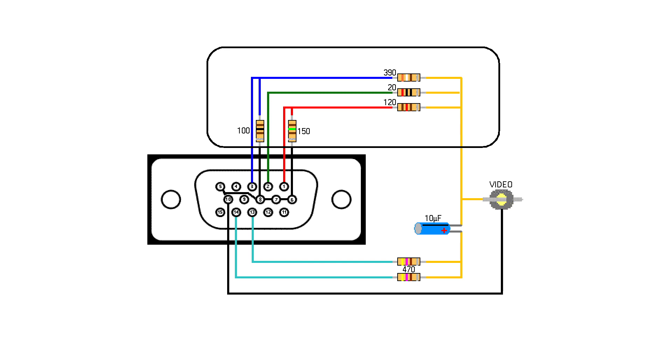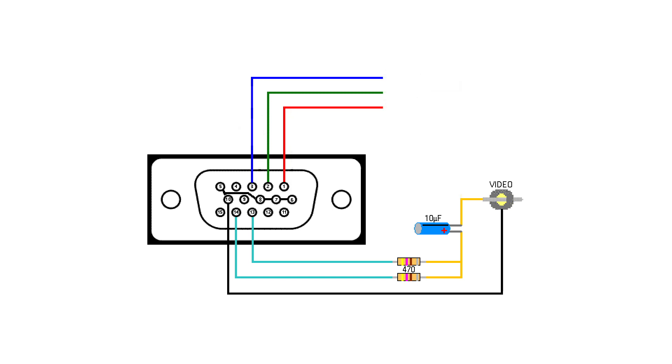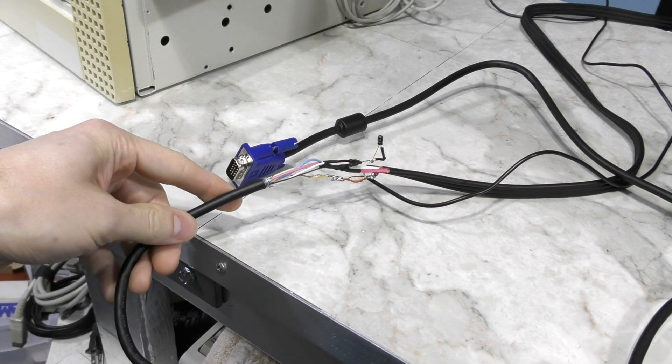This part of the circuit essentially takes the three different colors and combines them with different resistor values to convert it to a nice grayscale. After all, there is no way to get color on a signal like this because composite color is generated in a fundamentally different way. Technically you'll only need one color signal, but if you use the red signal for example, green text would never show up, so combining them probably works best. This portion of the circuit combines the horizontal and vertical sync into a composite sync. I've actually used this design before years ago and it does work, but I'm going to make some modifications — I'll get rid of this section, the bottom part will become just a sync signal, and then I'll pipe in the red, green, and blue right into the TV.